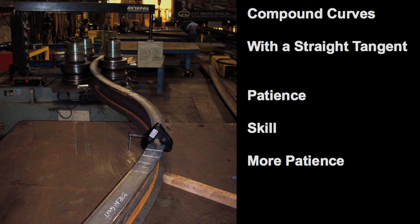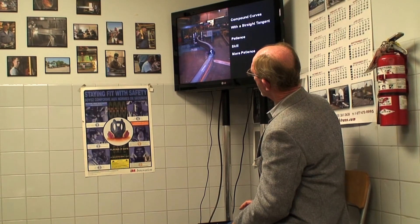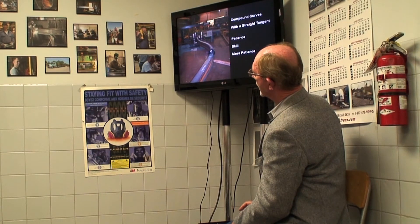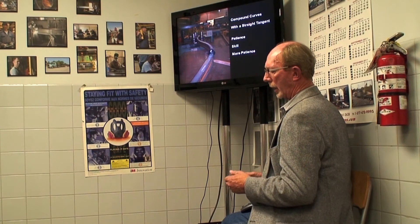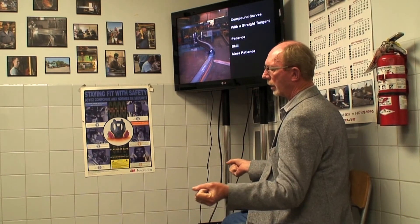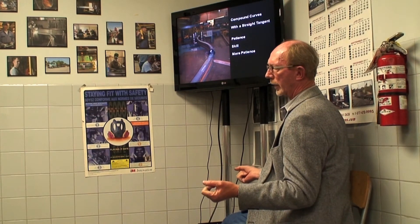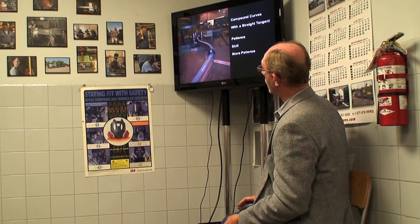This is rolling compound curves. This curve would have been rolled as one section, then flipped over, and this would have been rolled as another — you can see the start-stop lines, and then the straight sections. This is probably for a monorail, and it takes a long time to do. This is not CNC work; this is trial and error. They use what they call sine bars — a bar of a given length — and they calculate what the arc is going to be and how long the distance should be at the middle of that bar. They put it on the bar, take it off, roll it again, put it on, take it off. When they get close, they actually take a pattern of the actual arc and fit that pattern, back and forth, until you get what you need. So: patience, skill, and more patience.